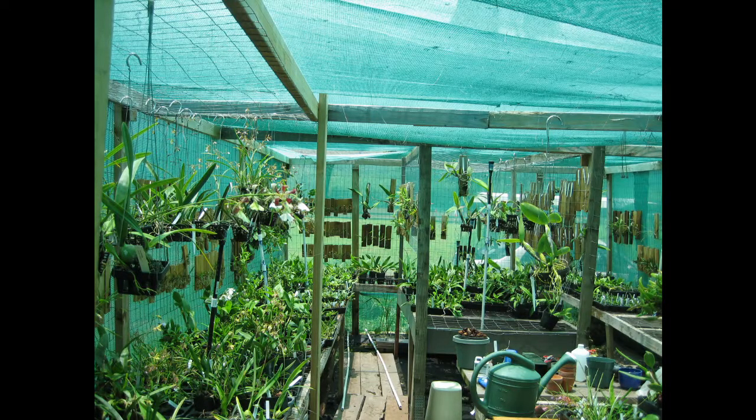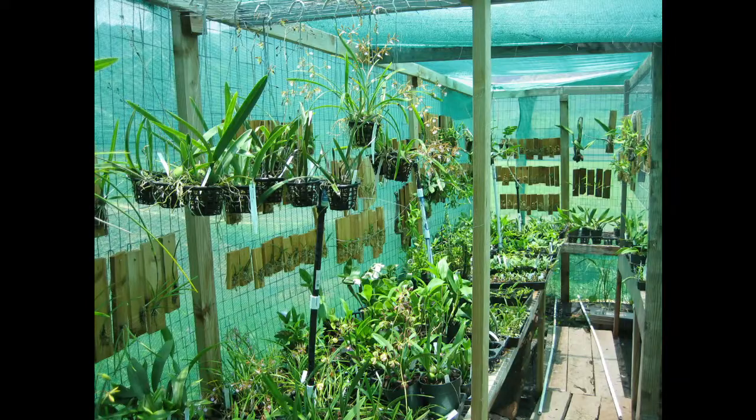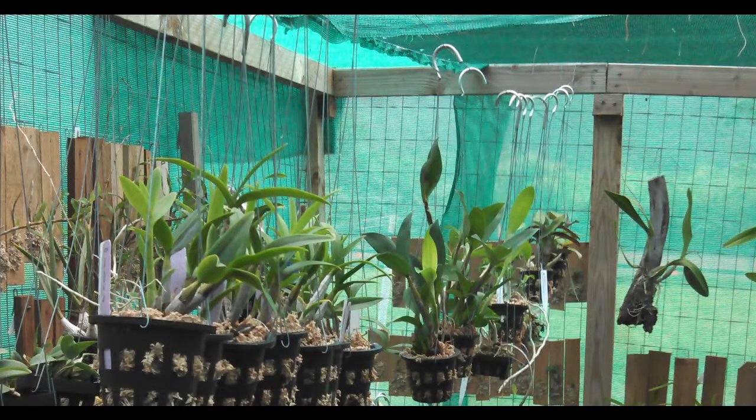One issue that persisted was the sagging of the overhead shade cloth and crossbeams. This was finally resolved by installing additional vertical posts on the inside of the benches. This added additional support allowed for the addition of many more plants because we were able to add overhead galvanized fencing. This dramatically increased the usable space. Effectively, the bench space was doubled by using baskets which hung from the overhead fencing.